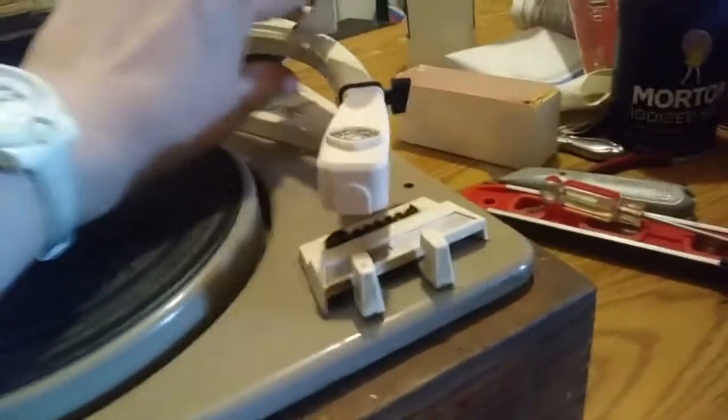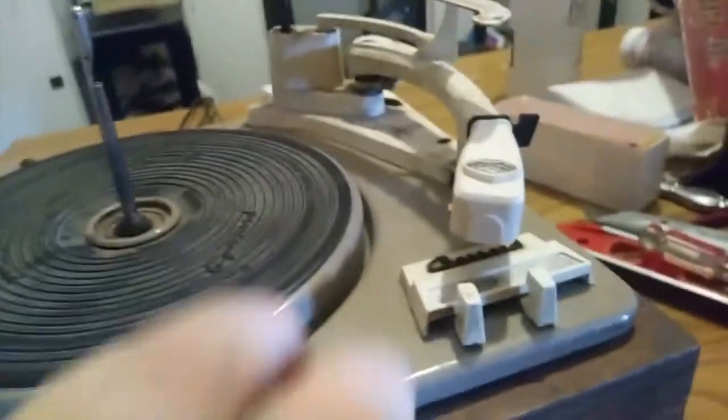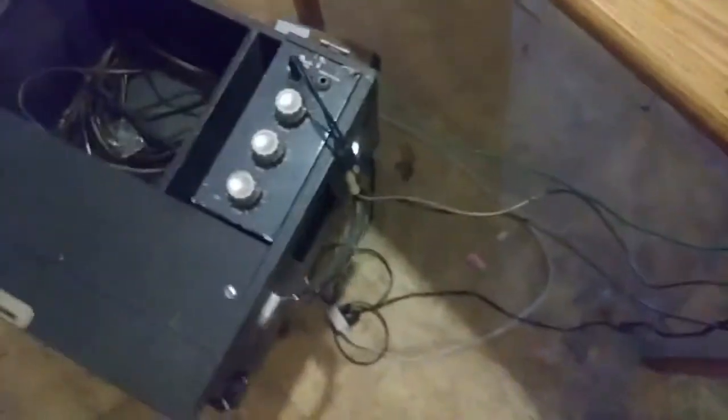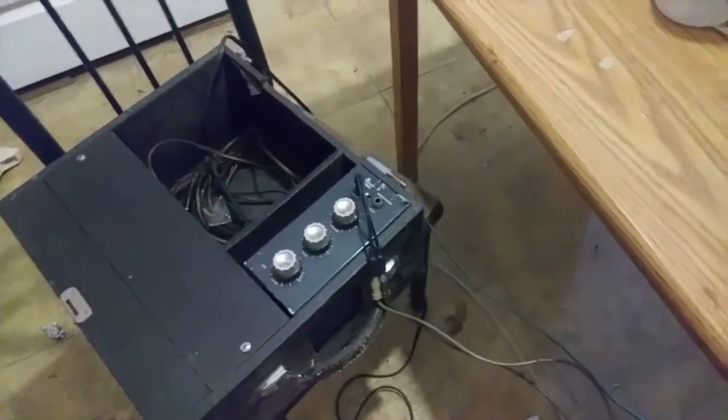It's still a little dirty, but this thing has a weight cantilever spring-weight mechanism designed to offset the weight of the cartridge. I didn't have a scale, but I know this cartridge tracks between four and five grams. Originally I had it set for the magnetic weight — for the original Shure RX25 XT — which was too light and it would just slide across the record. The amplifier is an old Voice of Music mono amplifier; since this is stereo, we used a Y adapter to connect both channels together.